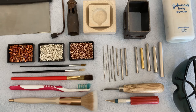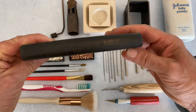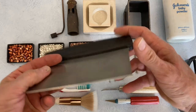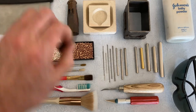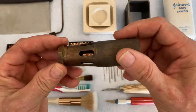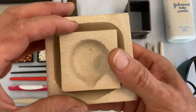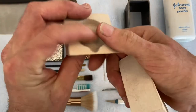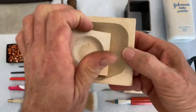This is some of my Delft clay casting kit. Not all of it is essential but having some of it to hand is needed. I use this to cut and chop my clay to loosen up any clumps — I'm not sure what it's called or what it's normally used for, so if you recognise it please let me know in a comment. A hot and fierce burner is important. I use either this oxygen and propane mixed burner or a large propane torch. I use these inexpensive ceramic crucibles. These two are brand new and need to be sealed and treated with borax before first use. They're held with some sort of long handle or tongs.